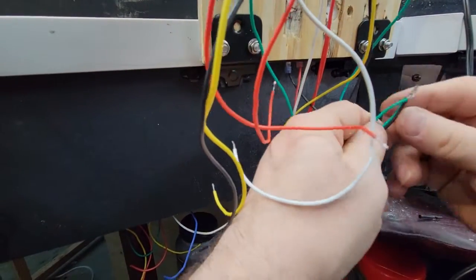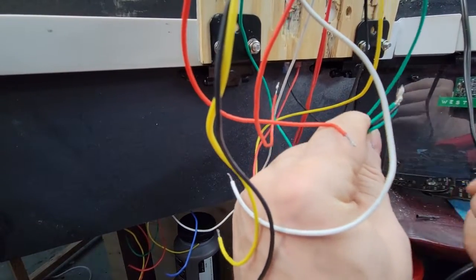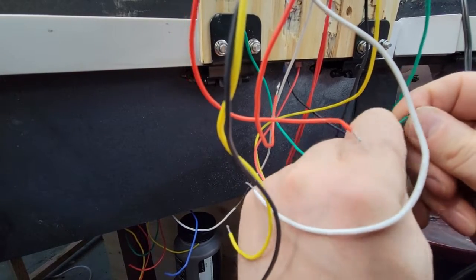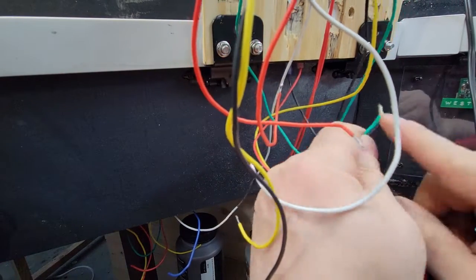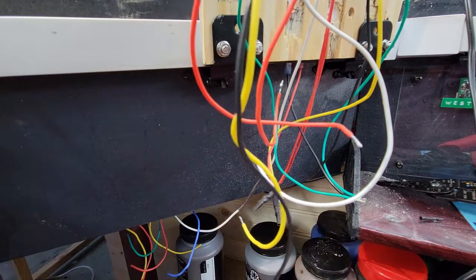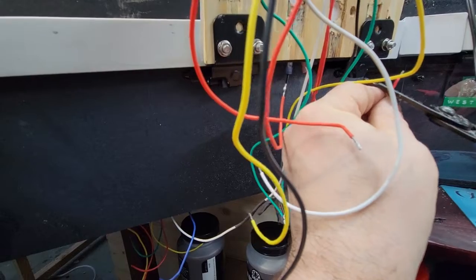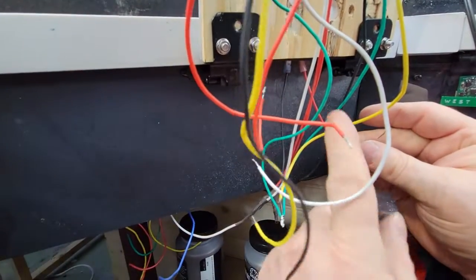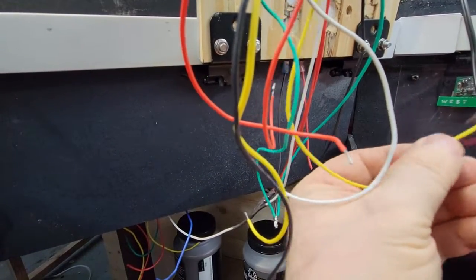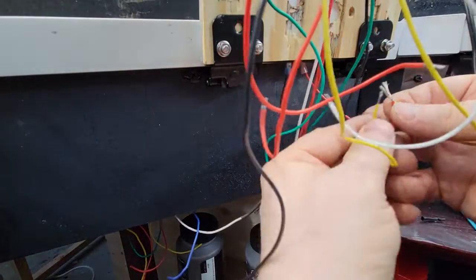As I had said before, I was going to piggyback the other switch off the existing 12-volt tap for my 12-volt DC bus. I have already spliced together the green wires to the black. The green wires are connecting to the switch. Let's prepare my red wire off the tap — cut that back a little further. For the red wire, we were connecting to the yellow wires on the switch. Let's put those three wires together and splice them and solder them.